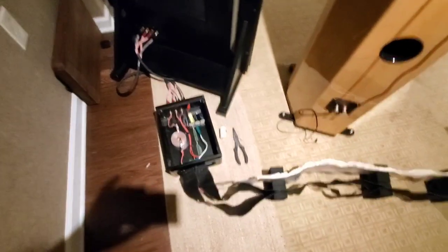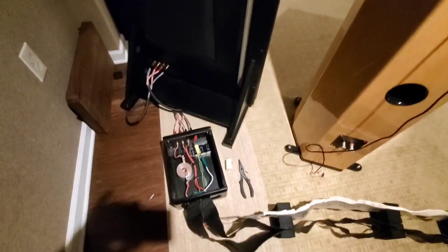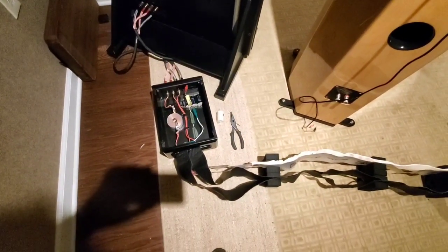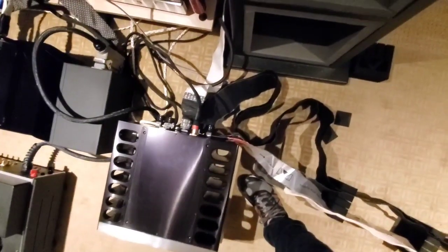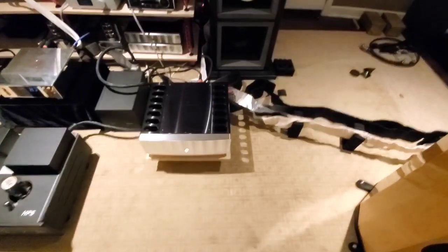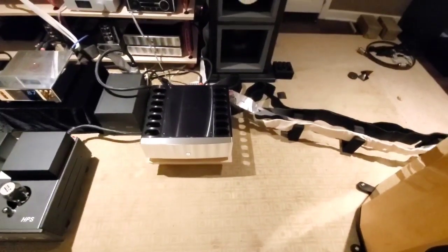They are planar magnetic using neodymium magnets - very killer sounding speakers. We're going back to a passive crossover that goes on the back of these things. I reconstructed them because the ones that came with it had the wrong values and someone had been monkeying around in there. We've got foil cables, and we're teaming them up on one side of the Roland - using one channel only.